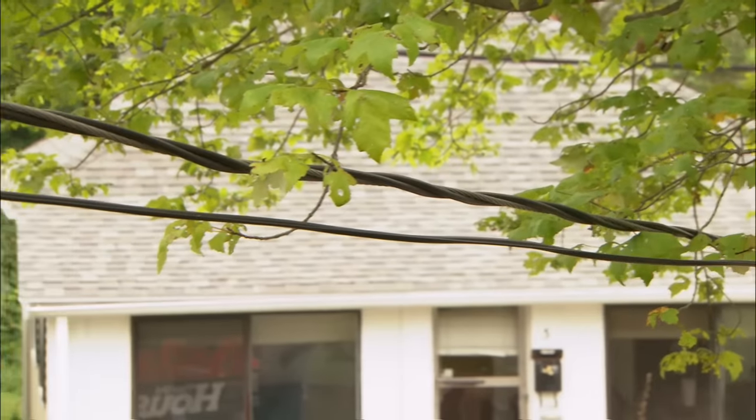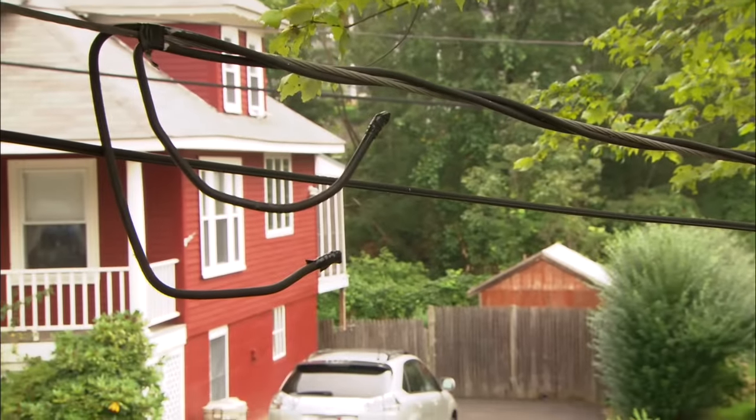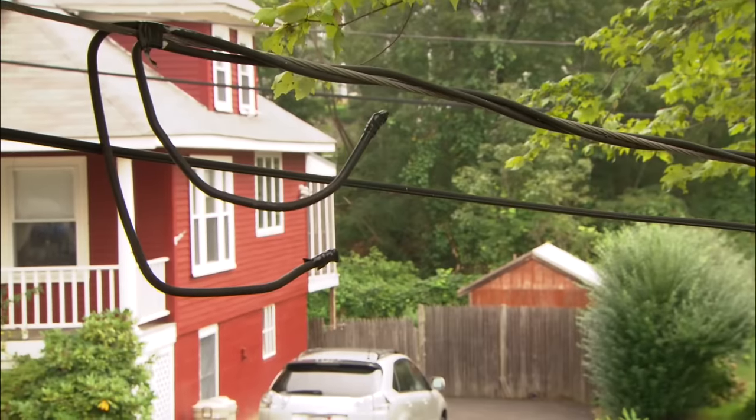What I've done is called the utility company and had them come in and disconnect their wires from your home, where they tie in and energize your home. Each one of these wires carries 120 volts to your house, and we can reuse them. There's no power to the house right now. I have a portable generator hooked up which will allow me to run some lights and small power tools while I upgrade your service.